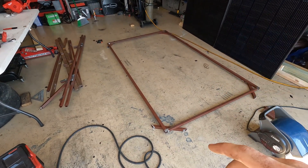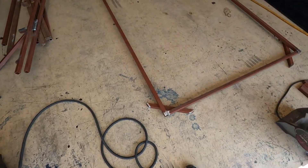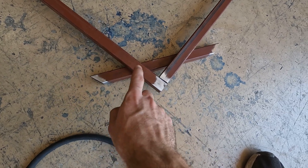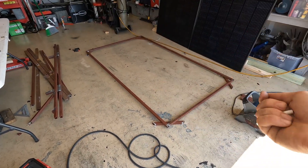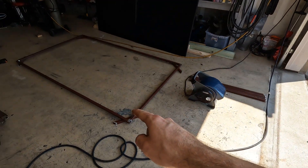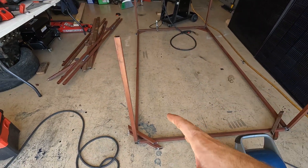About to tack together the basic square frame. You measure diagonally with your tape measure — if both diagonal measurements are the same, your frame is square. Also, if your floor is not perfectly level, you can place pieces underneath the corners to help get them straight. I'm going to get these lightly tacked together, not burn them all the way in at once because you don't want things to warp. Then we'll get the feet attached and slowly work around getting everything welded up. Our feet are all welded on and pretty straight.